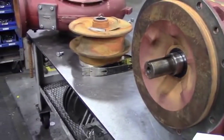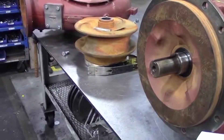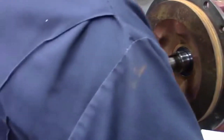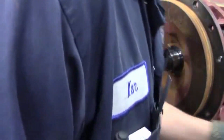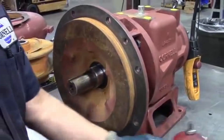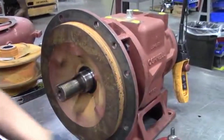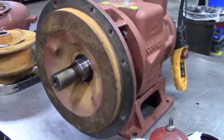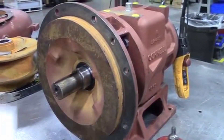As you can see, once the STP is applied and with the PVC pipe, they slide in pretty nicely. You want to make sure you push them in straight. If you cock them, you could possibly crack or break them. If you crack it or break it, you're going to know right away because usually you'll see a chip or hear a loud popping noise as you install it.